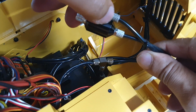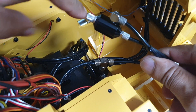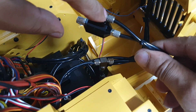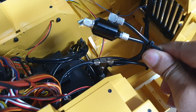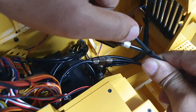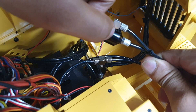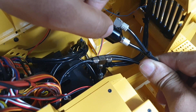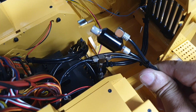if you open this valve, all the oil is going to flow through and just go back into the tank. Now if you actually close this valve by tightening it, it's preventing oil from going back into the tank, and hence the oil in this line is now going to be fed into your valve block. If you tighten this, you're shutting it and you're preventing the oil from the discharge side of the pump going back into the tank. Hence it's keeping more oil fed to the valve block, and hence it creates more pressure.